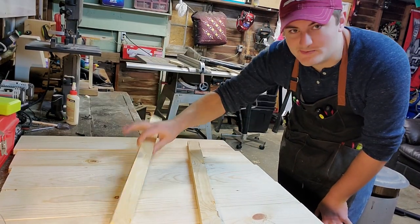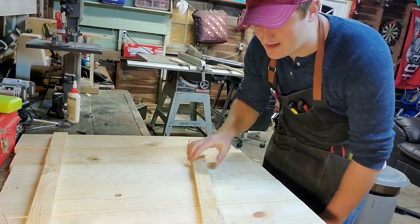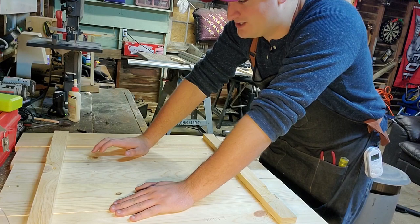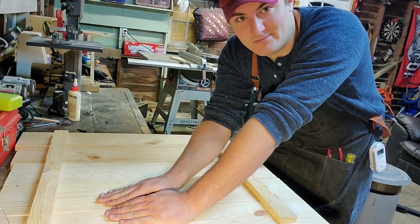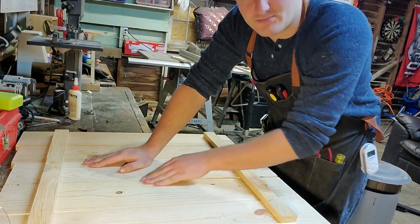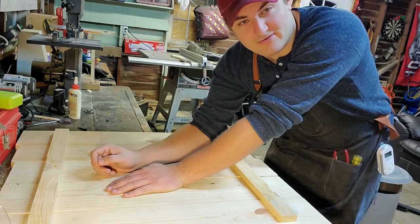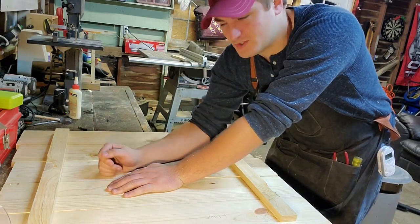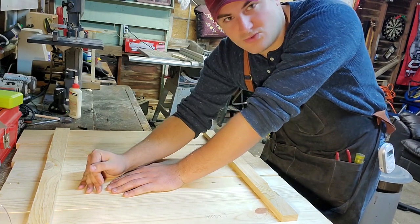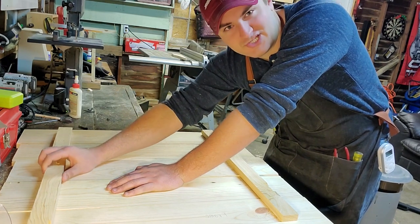I cut these two backing bar pieces — that's what's going to attach all the boards together. The reason I'm not gluing them is I really don't like to join anything butt to butt unless I have a biscuit joiner, which I don't have. Gluing without proper joints can get messy, and these boards can warp. They're common boards from Home Depot — usually pine, spruce, or fir — pretty cheap wood with a bad tendency to warp and crack. So I'm not gluing them; they'll attach just fine with the backing bars.